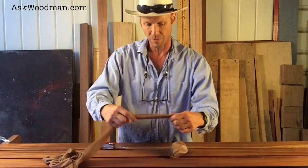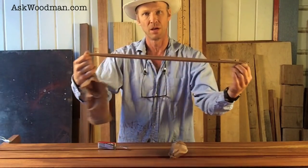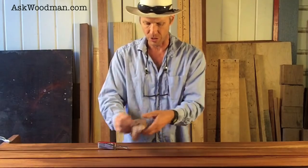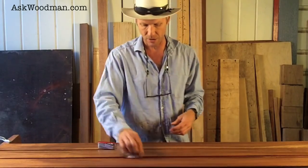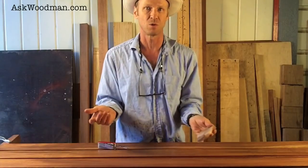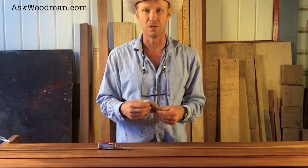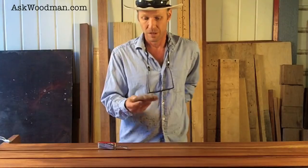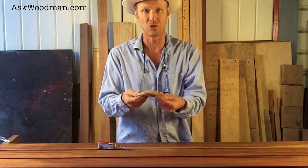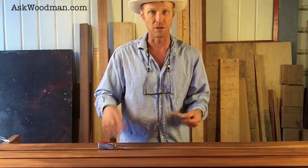So for the next pad, you tie a knot in it, put your pad inside it, and tie another knot on the other side. You can get four or five pads out of one leg. So here you've got a nice lint-free finishing applicator that gets into all kinds of little cracks and crevices. Because you may live in the country and not have access to foam brushes, or foam brushes may be expensive where you live — they're cheap where I live, about 59 cents for the big ones, but in some places they're $1.99 or two bucks. If your wife wears pantyhose and you save them, and everybody can come up with an old t-shirt or something, you've got a great applicator that you can apply your finish with, and then just toss it when you're done — you don't have to clean it or anything.